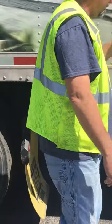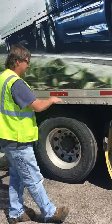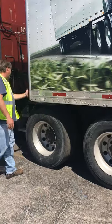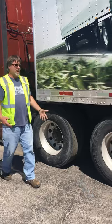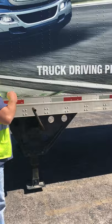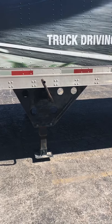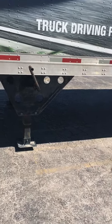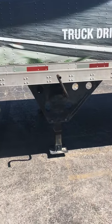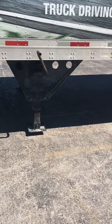The two speeds are useful for situations like this: let's say somebody else loaded your trailer and they have a truck that sits a little lower than yours, and you can't get underneath it. Let's say your frame rail hits your bulkhead up here and you can't slide underneath it — you've got to get under here and crank it up. Now this is geared like a jack. You can have a fully loaded trailer — 80,000 pounds of merchandise — and you can still lift it up just by cranking it. It takes a while, but there's no muscle involved. That's why it's geared like that.